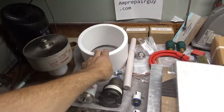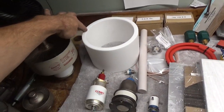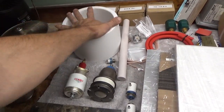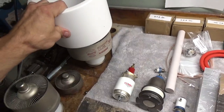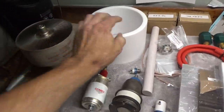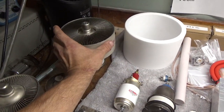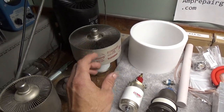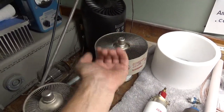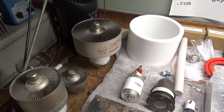You can tell by this chimney — it's like $200 something. It's just awesome. I'll still put a thin layer of silicone — even though silicone doesn't really stick, it'll stick to the floor and make sure it has a perfect seal. See how tight that is? Look how tight that is — and it goes down about half an inch. I'm going to go around the tube for the connection for the anode, so all the lead lengths are going to be super short. When you go to the nipple in the center, the air going through the cooler ends up heating up the strap, which heats up the plate blockers — not a good idea.